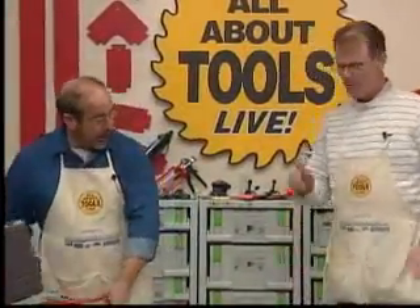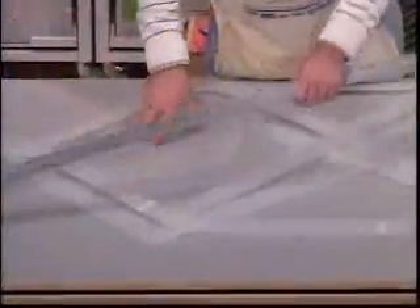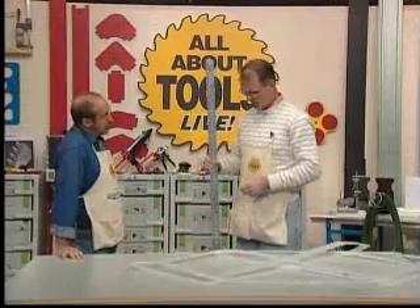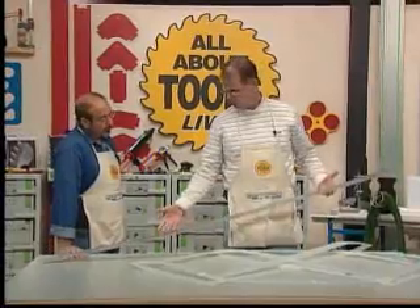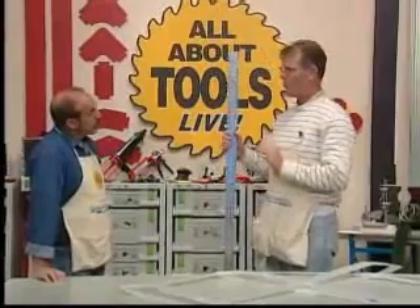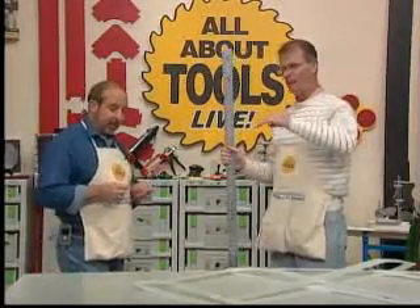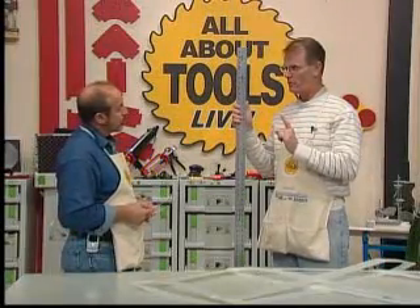Let's take a look at the template that we actually make. But first, one thing I really didn't get much chance to talk about the other night: it really is important to have a good metal straight edge. When I had my own business we used these all the time — it's a six-foot aluminum ruler, really a straight edge. The great thing is that almost every manufacturer requires the countertops or cabinetry to be in plane, not level. They are not concerned whether the cabinets are level and plumb.